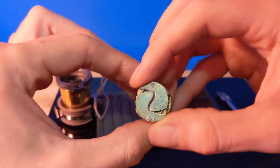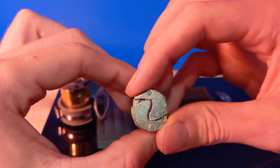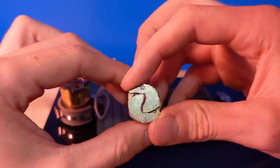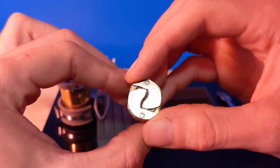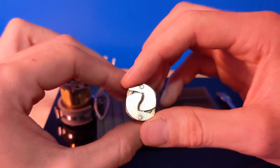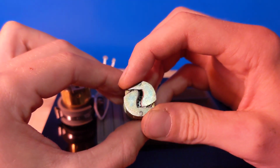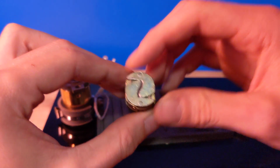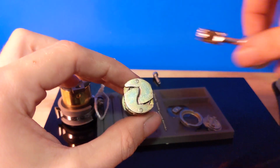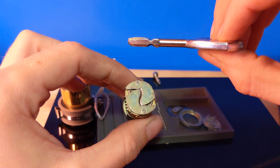The cam, or the shutter on here rather, when it's at its resting position in the very front of the housing, it's able to open up as far as it would like. But once you start tensioning the lock or inserting the key, it pushes back a little ways, and it's only able to open up to about there. And to correspond with that, there's a pinch in the diameter of the key as well.